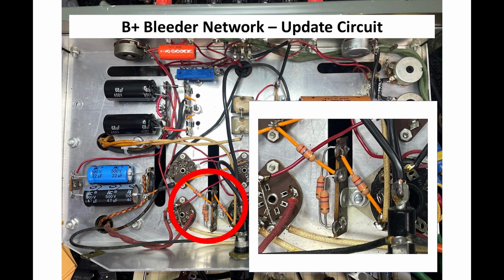Initially, until the dual diode rectifier, that 6X4 tube, went into emission, I was seeing some strange voltages, a couple of volts of opposite polarity across the capacitors. I stopped a couple times to check to make sure the wiring was right. When I got the voltage up to about 60 volts, the polarity on the capacitors changed. I never saw more than about 4 or 5 volts opposite polarity across those capacitors, so I didn't think it was anything to worry about. And that's where we are.